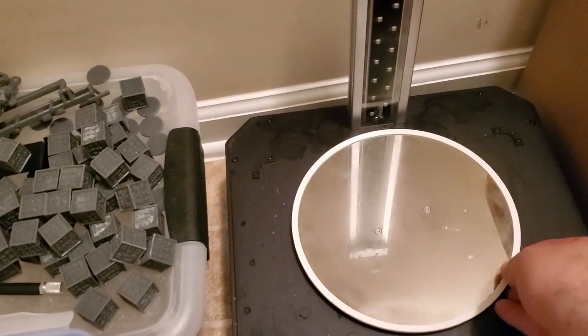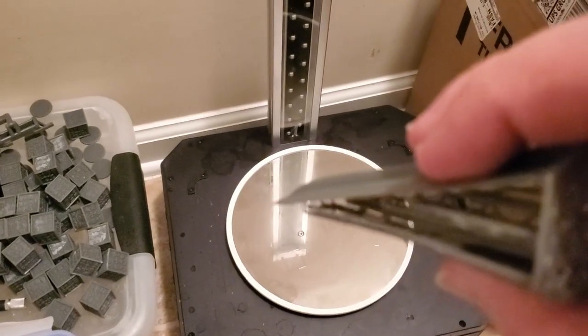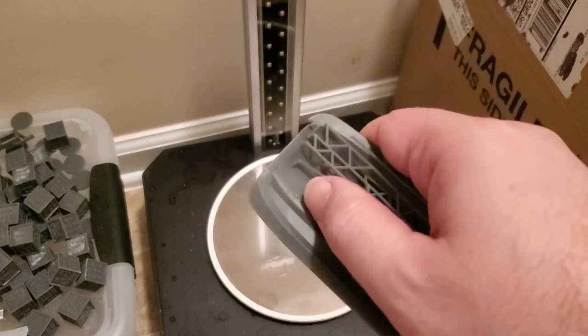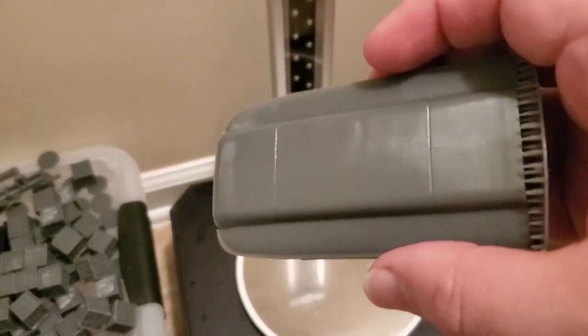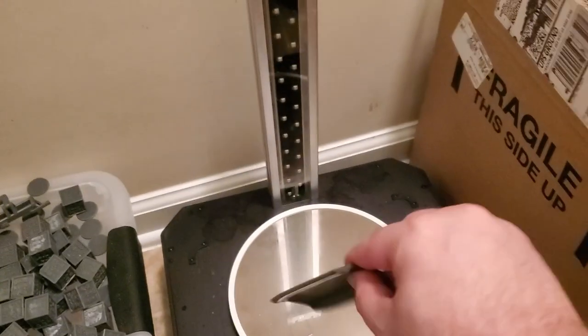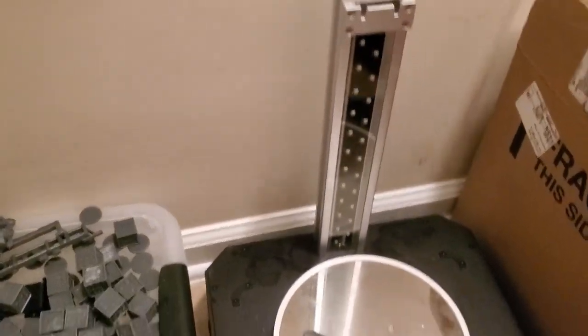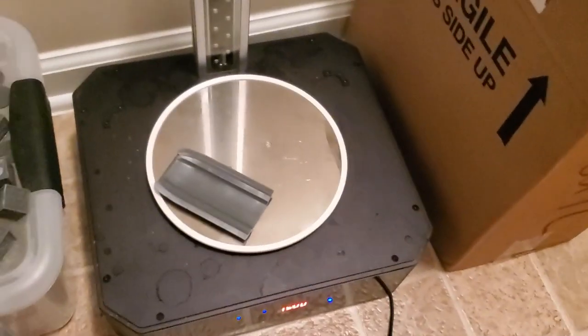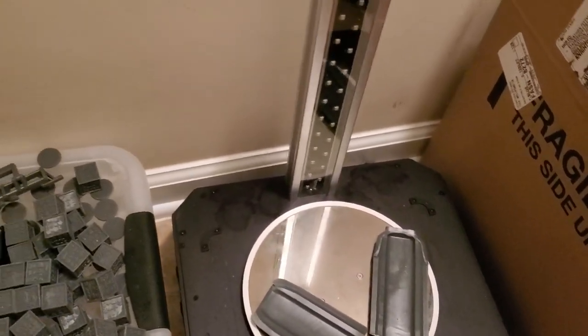So we are ready to cure — that magnetically slots right on. Now we're going to remove our struts first, and these will generally just peel off. You can see they come right off. The way these are supported, any residual pieces will be on the underside, so that really helps. I'm going to run it for probably five minutes at a time, do one side, then flip some pieces and do another. Looks like I'll only be able to do a couple things at a time.